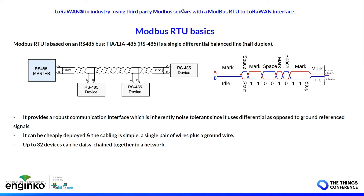We focus on Modbus RS-485 because it's the cheapest and easiest to set up. It's differential single-line, half-duplex — meaning there is only one channel for both transmission and receiving. There are at least one slave, two logic levels (zero and one), and an additional three-state level. The communication is very robust, noise-tolerant because it's differential, and if well implemented, very reliable. It's cheap to deploy — the cable is only a single pair of twisted wires and a ground wire. You can connect up to 32 devices on the same daisy chain bus.